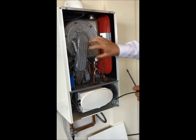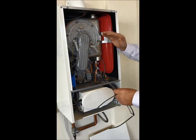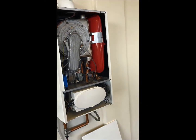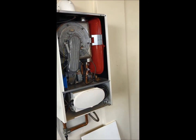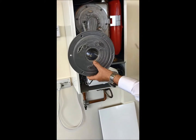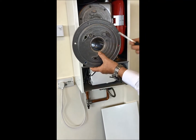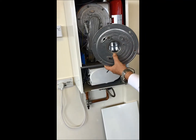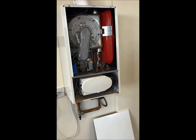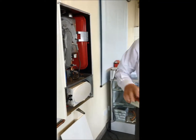There are various ways of checking: you can take the front off here and give it a vac out, you can take the whole lot out. But always make sure that you check that the burner is clean, because what can happen - if we look at the burner - you can end up with a high level of debris across the bottom end of the burner here.